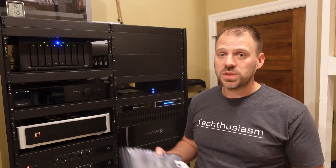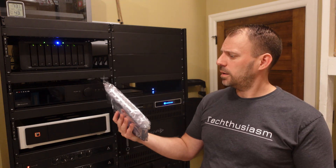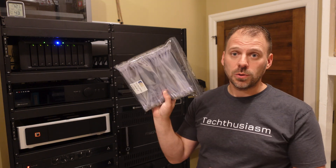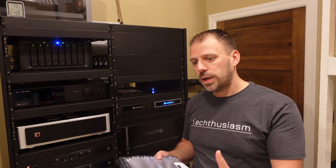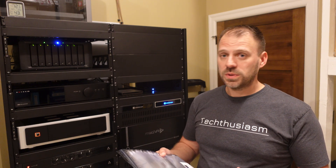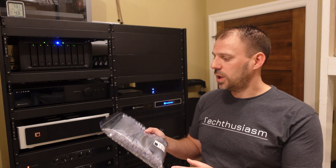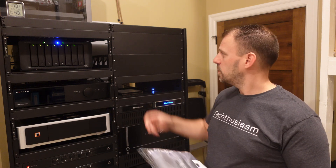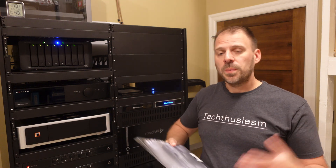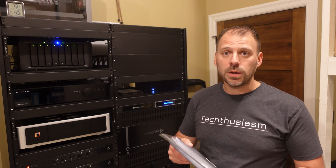The rest of this stuff is basically a jump-start to the cabling and interconnects. I did buy the 50-pack of Ubiquiti patch cables. I didn't need the Ether Lighting ones, which saved a little bit of money — so some of the extra cost of the Enterprise switch over the 48 Pro Max PoE switch was saved back by not buying 48 or 49 Ether Lighting patch cables. Staying in-brand, especially for all the stuff visible on the front of the rack, this will do all the jumper connections between the patch panels and the switch, and one will also make the connection between the cable modem and the Dream Machine.